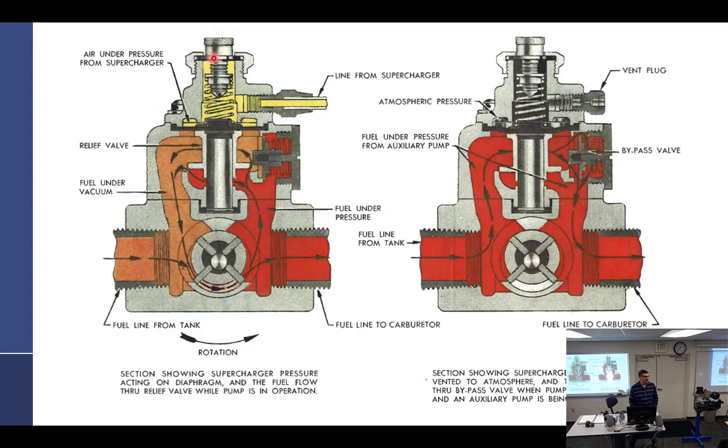If I want more pressure, I take this screw right there and screw it down. The way to increase would go to the right. The funny part is this is left-hand thread, so when you take it apart it's going to look backwards. I guarantee at least a third of the last class sat there at the oral and said 'turn it left for more pressure' because it's left-hand thread.